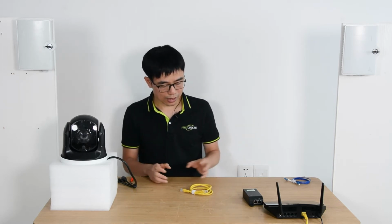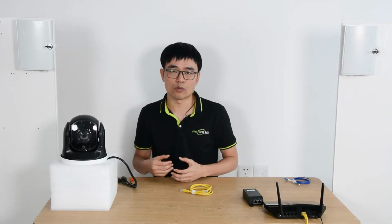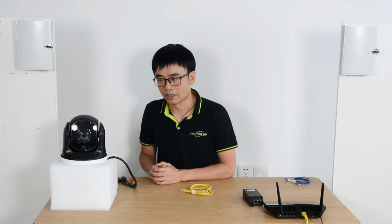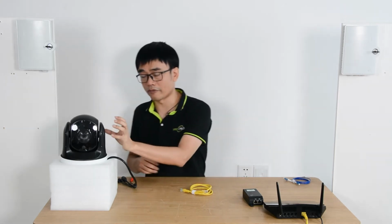Sometimes we may need more than 100 meters, even longer, like 500 meters. We still can use the ultra-long PoE technology. But in this video, I want to use the fiber optic cable, because the fiber optic cable can provide long distance, fast speed, and low latency, especially when you have multiple cameras which require high bandwidth.